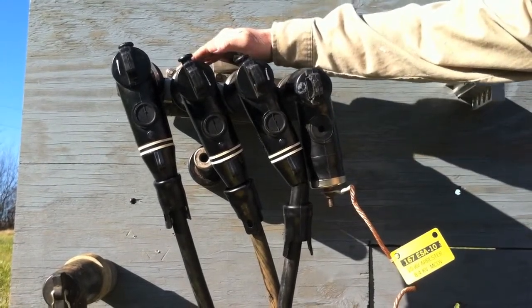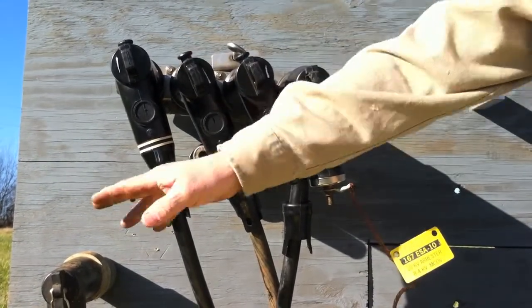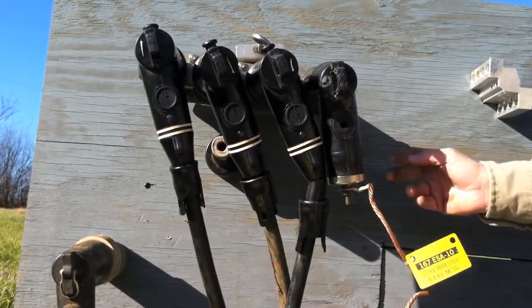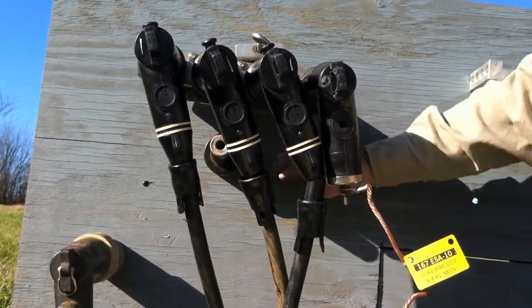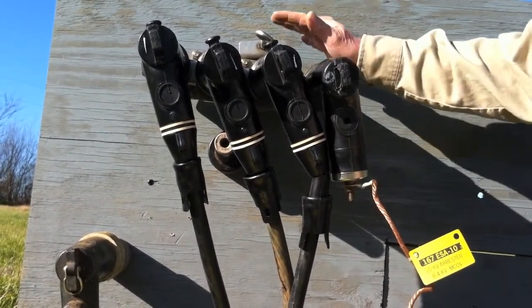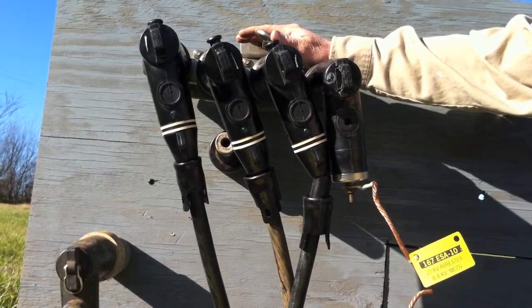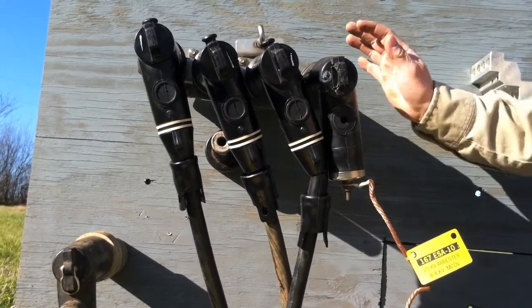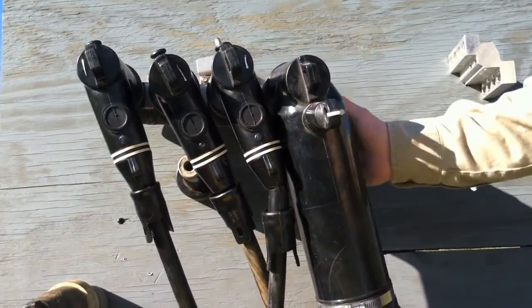Also, another feature this will help is fault currents. Now they go through our transformers, going back out to the main line, to ground. That puts shock load onto the transformers. This will reduce the fault current that the transformer sees. It will see a little, but it will reduce it, and can be a big help to saving the transformer's life also.